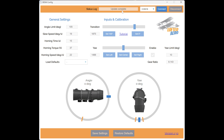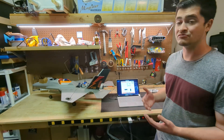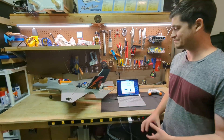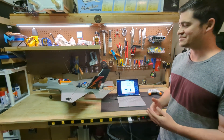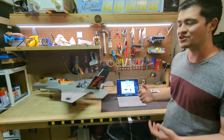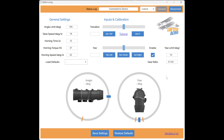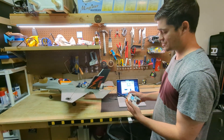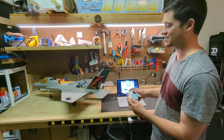Now the update is complete. The control board is going to power cycle so we'll see the homing sequence happen again. The nozzle already started straight so it didn't have much homing to do. The update did disconnect us from the 3BSM control board, so to reconnect we'll just click the Connect button again. Now the update's been applied and everything works normally — if we switch flight modes we'll see regular motion control of the thrust vector angles.